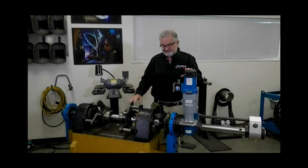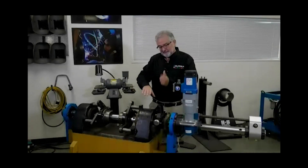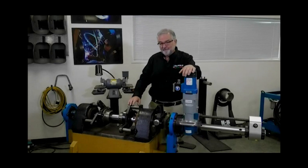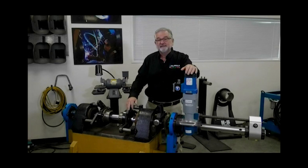This particular facing head is designed so that I can place an L-shaped tool bit into here and go into the bore and radially feed to re-cut or to establish a new snap ring groove. Oftentimes a snap ring will go in there — I slide a bushing in and then put a snap ring, or I put a bearing in and put a snap ring behind it so it can't walk its way out. That's kind of the basic use for this facing and snap ring grooving tool.